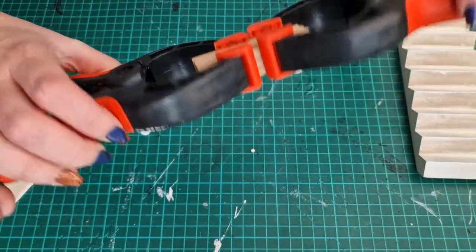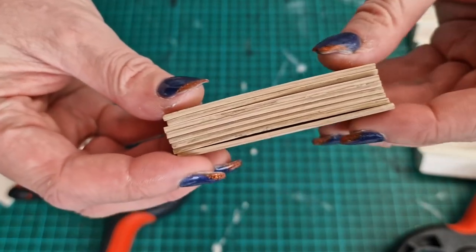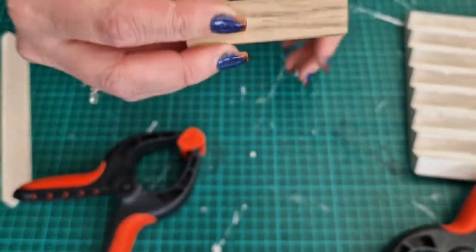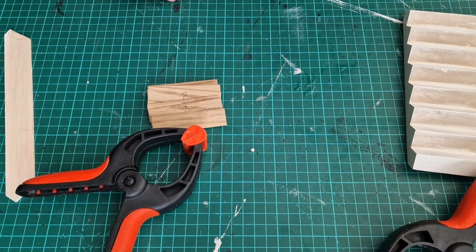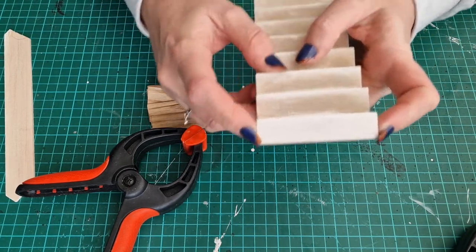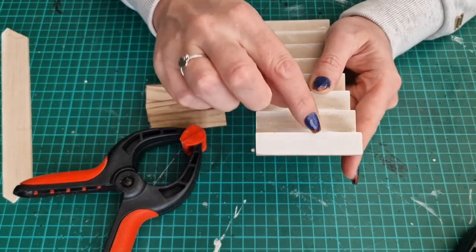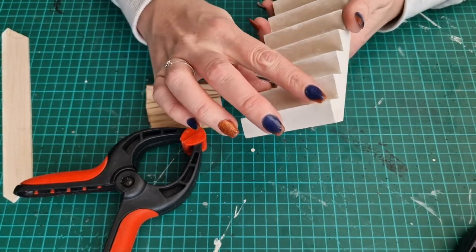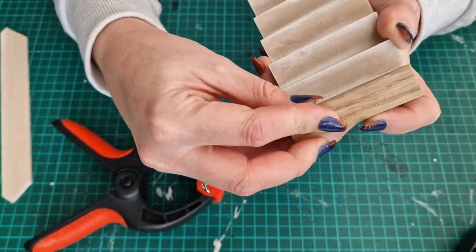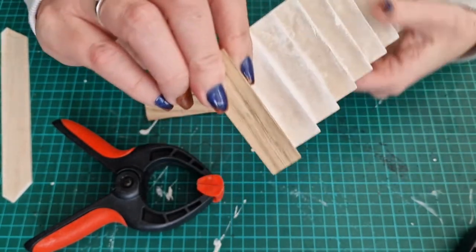There's still a very slight bend on some of them, but I think once they've been glued down, if I clamp or hold them on, the glue will hold them. So I've got eight treads and eight pieces. How I made these: I just measured the length of each stair tread and the width. I cut the exact length, which I think was about 71 millimetres, and then for the actual tread depth I think it was about 19 millimetres. I've just added a mil extra so there's a very slight overhang. Once the tread's put in place - as you can see, flush with the back - there'll just be a very slight overhang at the front. That's the look I want to achieve.